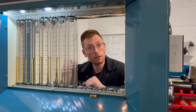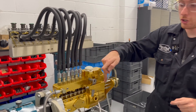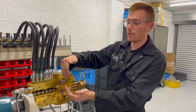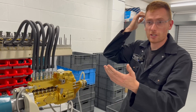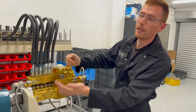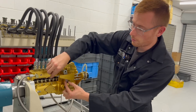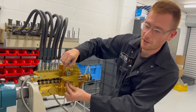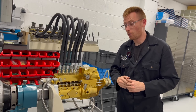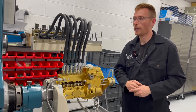If you were wanting to increase it, you could do the same the other way. And I say to everybody — it's well worthwhile measuring or marking before you actually start to move that. I hope that's given everybody at home an understanding of how the Alda system works: as it moves forward or further back, it changes the CC. By screwing those screws in, it pulled the triangle back, pulled that throttle lever back, and produced less CC. It's really that basic — and as you can see, as I pull it there it pulls the rack back. But don't be confused thinking that the rack is actually attached to the slider, because it's not — it all goes through the governor. Anyway, I hope you've enjoyed it. I hope you like my gold billet pump, because I really do. I don't want to let them go — I'm going to put them in my Christmas stocking. Bye for now.